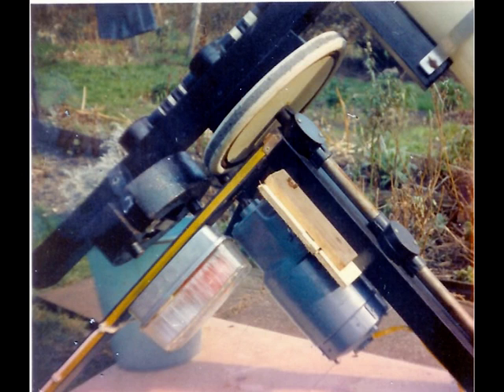You can clearly see I've added a red light for use at night. You can see the BBC stage weight there, quite low down just below the pram wheel. And you can quite clearly see the two through conduit boxes — electrical conduit boxes — used as bearings for the main 25mm shaft axis of the RA. All simple stuff, all available, all junk.